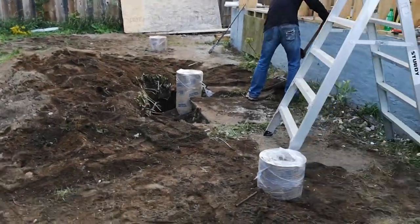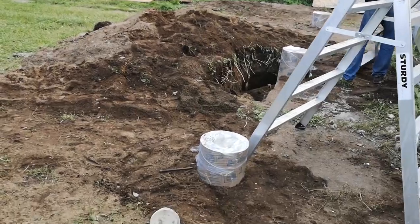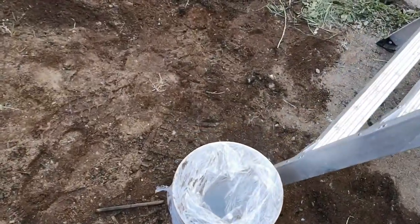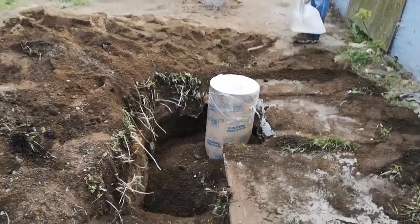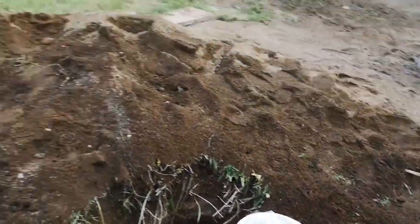So just backfilling the last of the three rear tubes, 12-inch tubes, the rebar's in there. And supposed to possibly get rain tomorrow, so we've wrapped them with shrink wrap. Or stretch wrap, just to keep the rain out. Sweet! Ready for inspection, all of the footings.